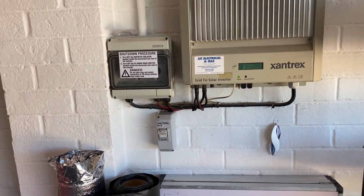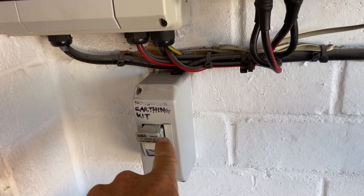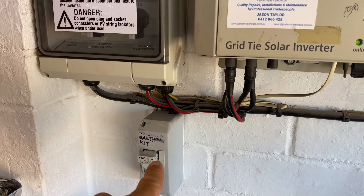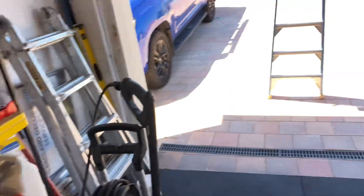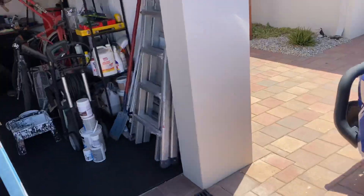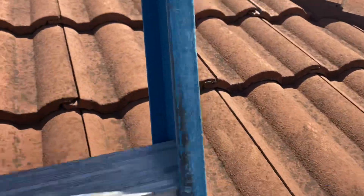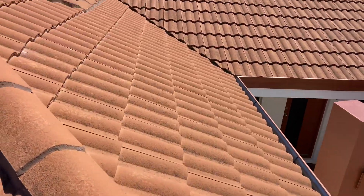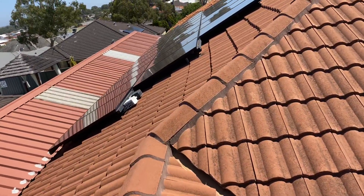What we've also got on here is this earthing kit. That's got a fuse in it, and if that fuse blows it shuts down the inverter. This was a retrofitting thing that caused a lot of controversy, because systems were installed and then the installation companies were told by the solar panel manufacturer that they needed to come back out and install these negative grounding kits. The reason for that was it was creating damage to the solar panels if the negative wasn't grounded or earthed.